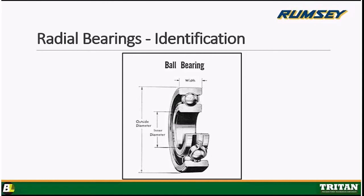It's very tough for us to discern what type of bearing you may have if somebody says, well, I can fit my thumb in the middle, which we get a lot. People say that, and it's not possible to, you need calipers. They're the only things precise enough when you're dealing with 16ths of an inch or millimeters. And the way you want to call out your dimensions is as follows: inner diameter, outside diameter, and then the width. Okay, so that's how you're going to call it out.